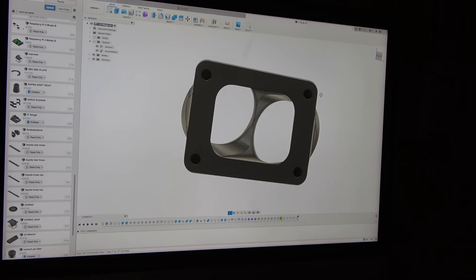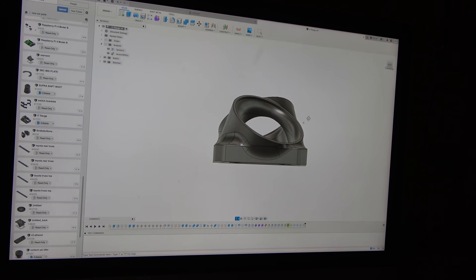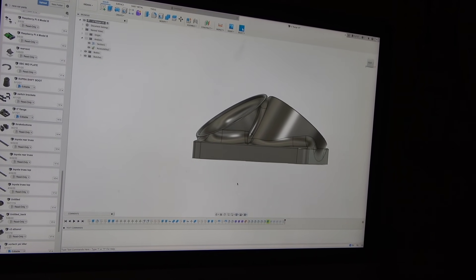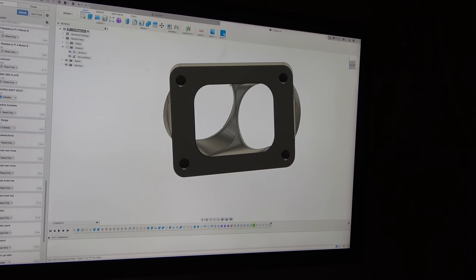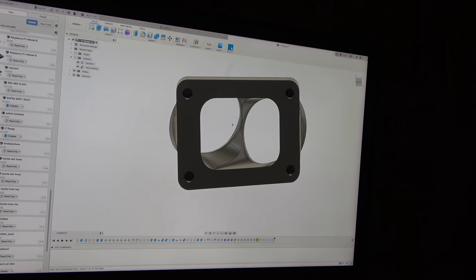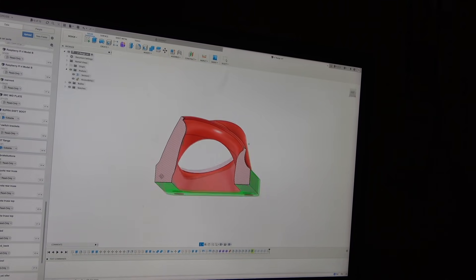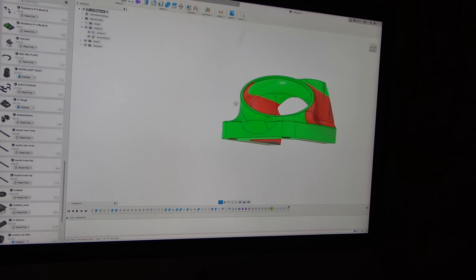This is the T7 flange - it's a very odd flange. We've got some threaded holes here. The flange is going to be oriented so one exhaust comes in here and the other exhaust faces toward the car and kind of loops back. I feel like this is a better option than the single flange they offer which is two four-inch straight out. This goes into a three and a half inch rectangle, so you don't need a four-inch crossover. You always want to size it to the smallest size because you want to keep your exhaust velocity up - the larger pipe you run the lower your exhaust velocity is, which can hurt spool. We did a CFD analysis to make sure the airflow is good. It's got a little step register that the tubing sets in, easy to weld, threaded holes and everything.